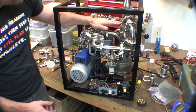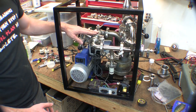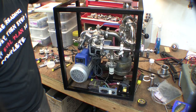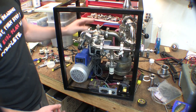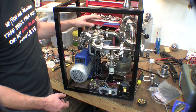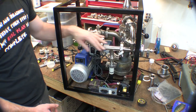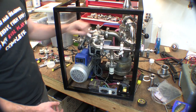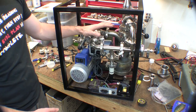So I've got one valve here which runs to the diffusion pump, there's another valve on top of the diffusion pump, and then there's another valve here. So I can actually isolate the diffusion pump, keep it under vacuum, do whatever changes I want, then with the oil diffusion pump still closed I can pump all of this system down with the mechanical pump, and then open the diffusion pump back up into the system so it's never exposed to atmospheric pressure - it's always kept under vacuum.